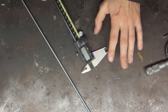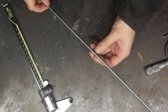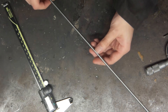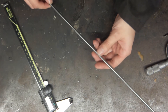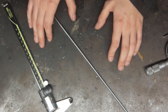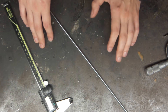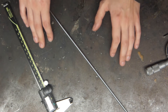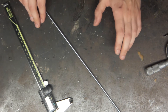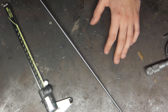Welcome back to the shop. Today we are going to be making a reamer. For one of my upcoming projects I need to make a tapered reamer to make two very small tapered holes. This is likely available commercially, for clocks and that kind of thing. The idea is to show you how you might go about making a fairly precise tapered reamer at home, just out of O1 steel and with relatively common machine shop tools. We're going to harden, temper, and then hone it.